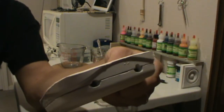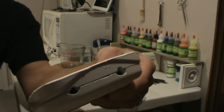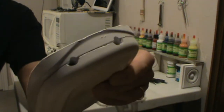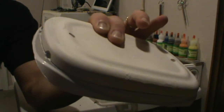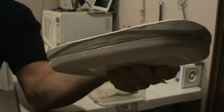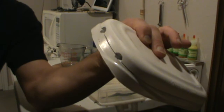The enamel works really good as far as the bait release goes. The problem with it is it takes about a week to do a mold. You'll pour the mold and it'll be ready to go. Literally, this mold I could have poured in an hour and had both pieces another hour in the oven or so at 225, coat it with Elmer's glue, and it's ready to use.